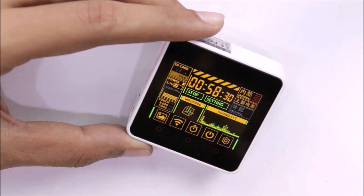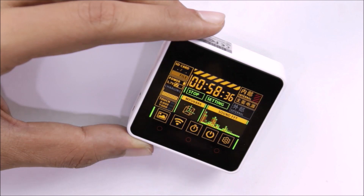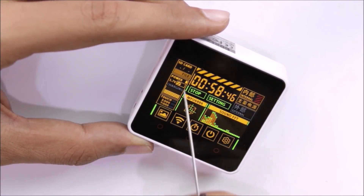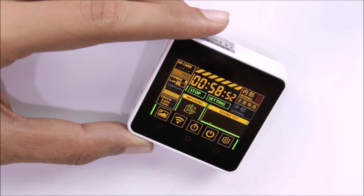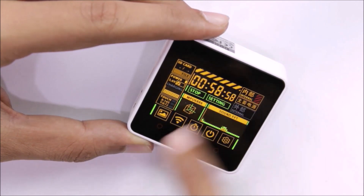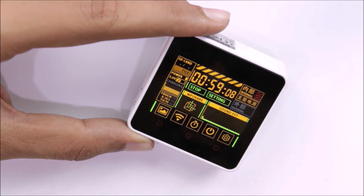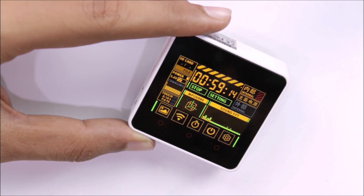There's a small animation showing how effective the TFT display is. We can also see the current battery voltage at 3.7V with the charging indicator. The touch information section shows the X and Y coordinates of wherever you're touching the screen — for example, touching a spot shows X=165 and Y=072. This coordinate data is something you'll use frequently when programming the device.